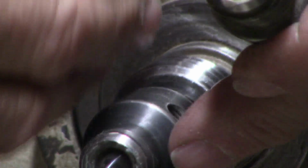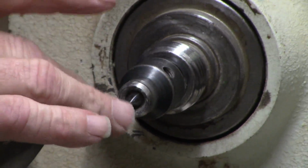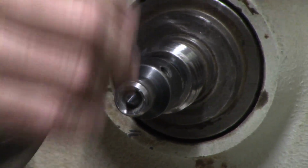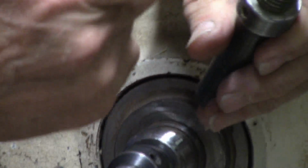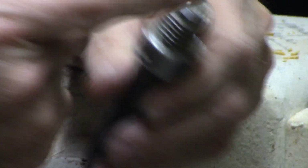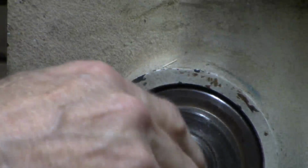Well, it's in the lathe now. Well, you can sharpen this rim with a file, a fine cut mill file, because you want that sharp. You want to drive that into the wood. But to have it drive in woods like Osage orange, hard maple, cocobolo, I take a chainsaw file and I cut 3 little notches. Turns out 3's enough. And it'll drive any of those woods. No problem. Hold still.